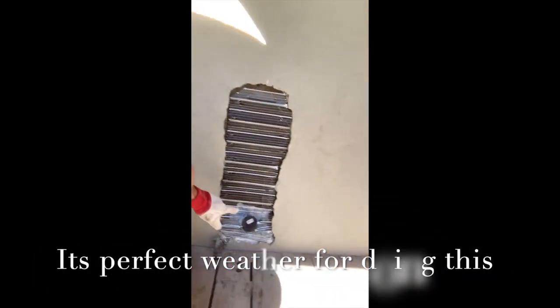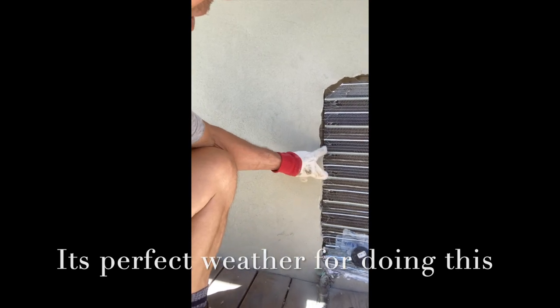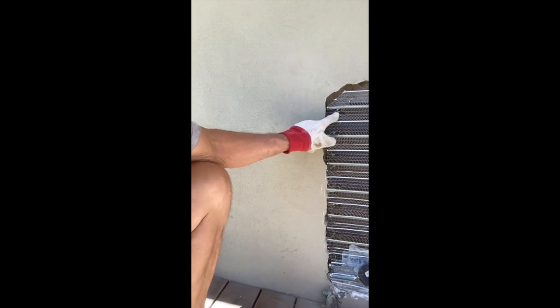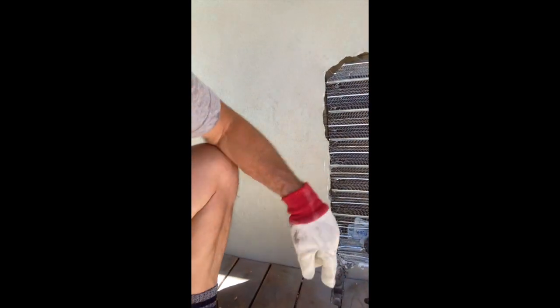This is a pretty good repair that JR did for us. He has the wire over the new high-rib lath overlapping the existing wire two inches on each side, and he also has tie-wired the existing wire in with the new high-rib on every six inches all the way around. We're going to get this masked off, then put a real scratch coat on and double it up real fast, then float it to match the existing texture and the homeowners are going to be happy.